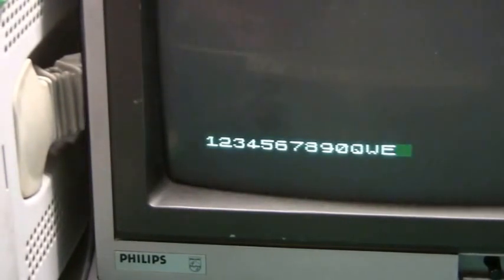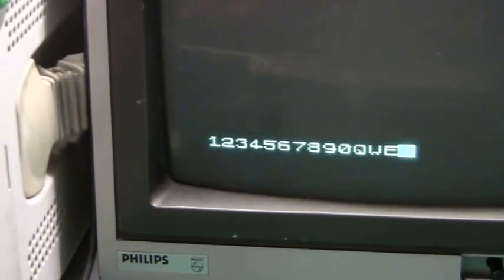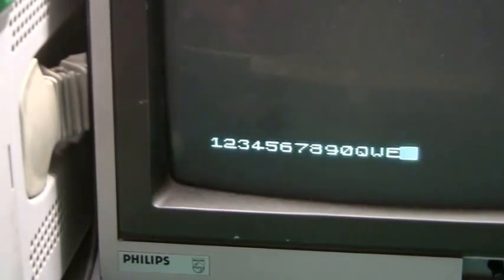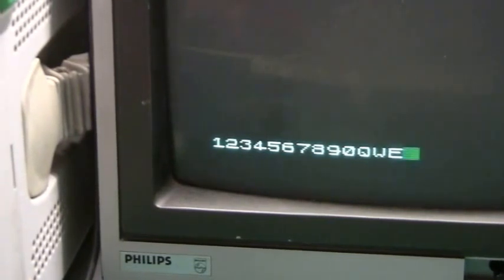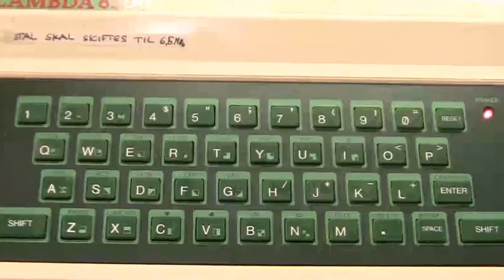What I thought would be a very easy repair job — simply switching back the crystal to 6.5 MHz — actually turned out to be quite a long repair. First there was the crystal to change back. Secondly there were some bad PCB traces — this PCB is okay quality but you cannot solder and desolder too many times or the tracks will come off. Then there was a missing loudspeaker and a missing TV modulator. Then there was a problem with the Zilog CPU because of overvoltage coming from a badly designed ASIC. But in the end I got there — that's it for this time. Thank you for watching and see you again soon.